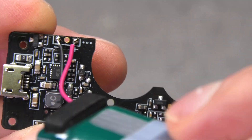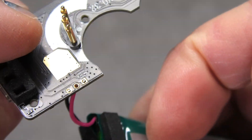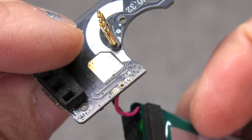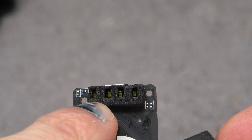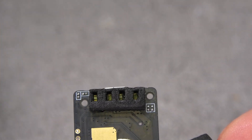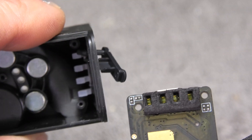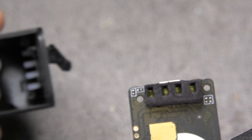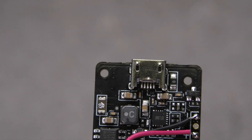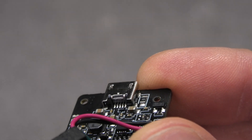In case you need to replace or fix the micro USB charging port, you can see there's very little space to work with - a lot of other components are in the way. Here also is the battery connection point, which is easy to unsolder. On the opposite side of the micro USB port there are four LEDs inside a little foam piece, and those are responsible for illuminating the battery charging state indicators.